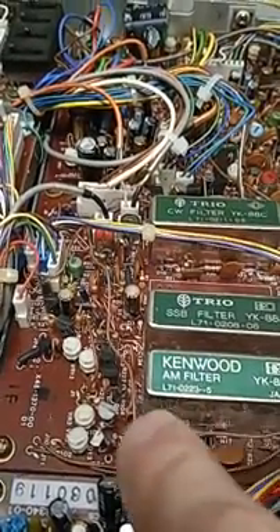These screws here — note the rings around them, those are ground points. Those screws have to be tight and should be cracked loose and re-tightened every now and then, though they'll come loose more quickly after the threads wear. Taking one of the boards out and twisting it broke one of the coax cables, which were connected with special terminating connectors soldered into the board. When the coax broke, the receiver had no frequency control and would pass everything. That was replaced with RG174 just soldered to the board-level connector.